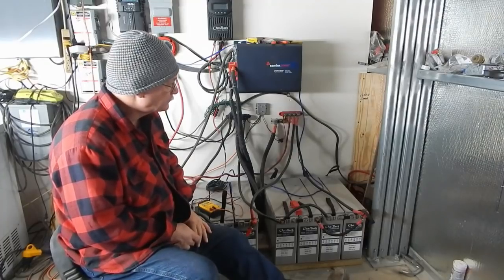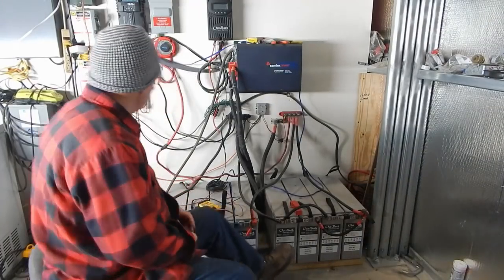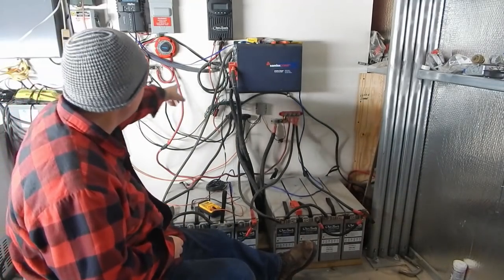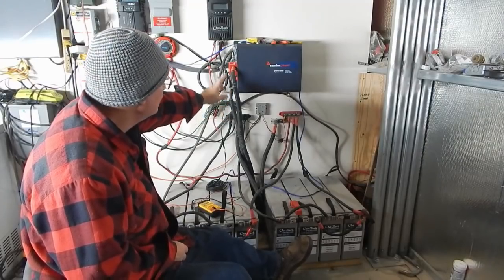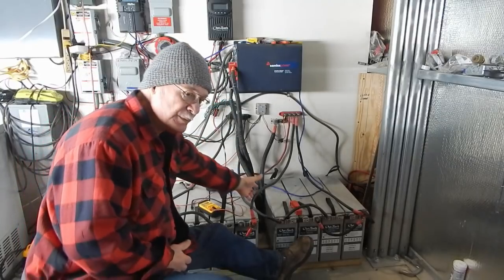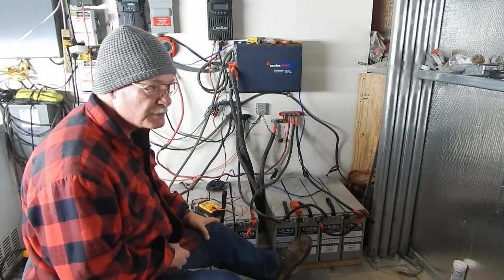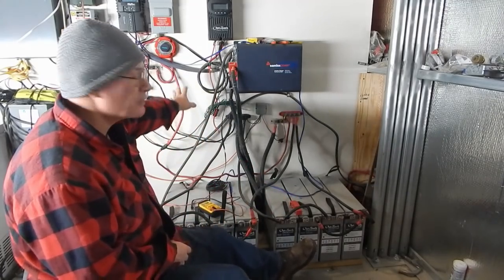Since I've been here, I have been using quite a bit more power. And occasionally, over here — I don't know if it's in the frame — this transformer, when those batteries get down to like 24.5, sometimes it will overload the inverter. I've got to shut it off, turn it back on. So I'm going to upgrade all my cabling to 4-0, which is one size more than it recommends, which is a good thing. And all my interconnects as well, and clean up some of this other stuff.